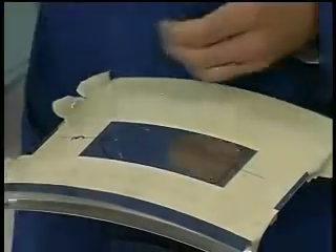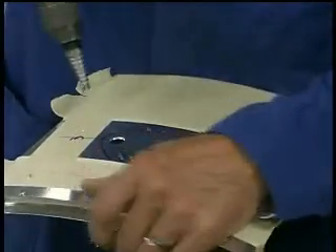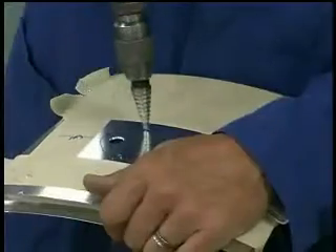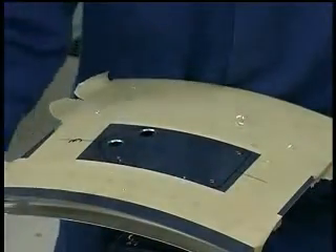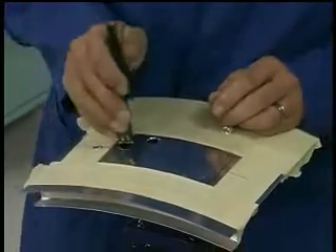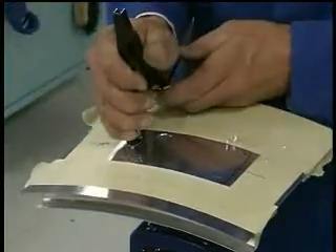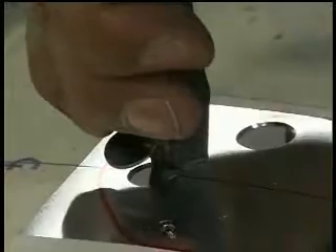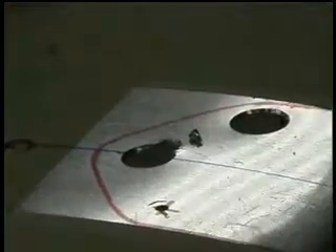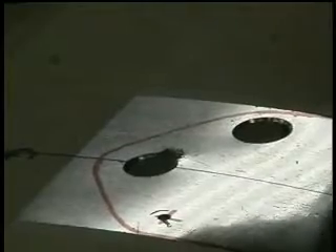I'm going to drill at least a half inch diameter hole — one spot here and another spot over there, so I've got two holes which are at least a half inch diameter. If the nibbler fits through, I know the hole is big enough. The nibbler goes through the hole; slide it forward in the direction you want to cut, then squeeze it and pull it forward. It cuts little chunks of aluminum bit by bit, biting its way through — kind of like a Pac-Man action.